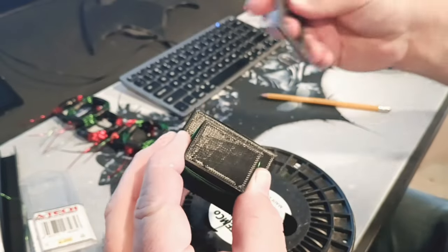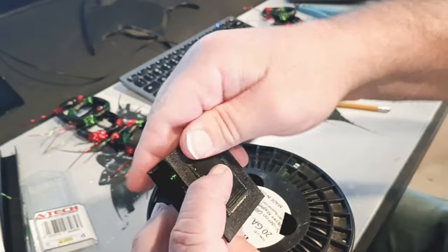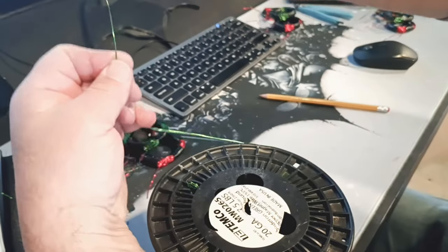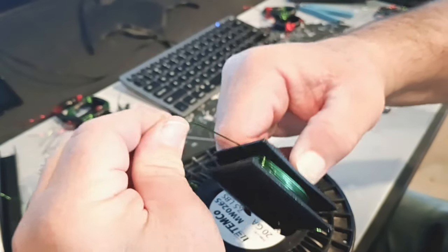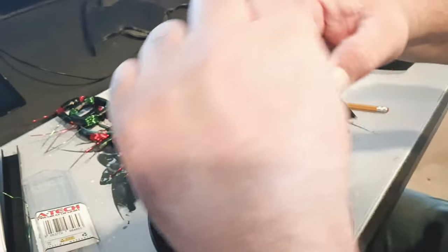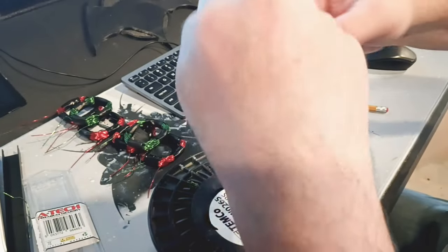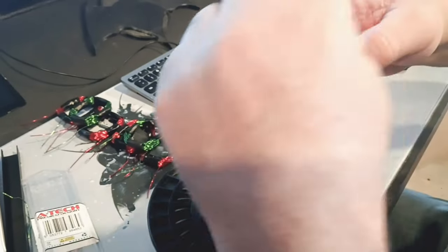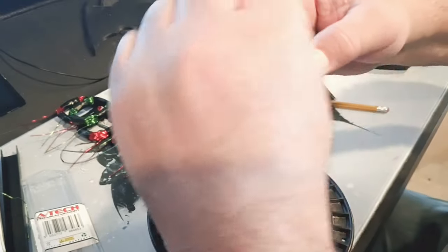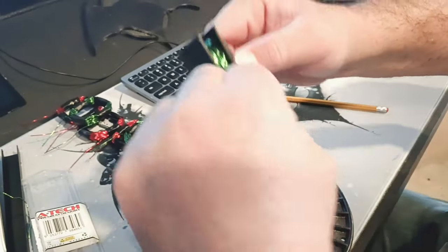Take this top piece here — we're going to slide it right over the top. And there we go. Hold it there — you can see the coils are nice and tight in there. Then we're going to just start winding again. This is just like you're doing your weed whacker, it's nothing real special. It's just getting the coil in there — make sure you don't get caught up in any corners. I've done that a couple times and had to unwind it, it really sucks. We'll just continue winding here for a little bit. You can count every one of your winds, or you can get them close. I generally try to count everything — I don't have the exact number right off hand. Whatever you do on this one, just make sure you do it on the other ones.